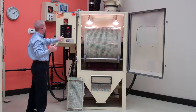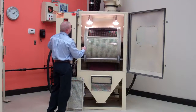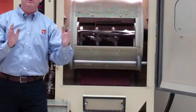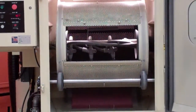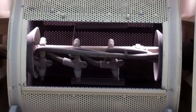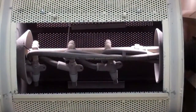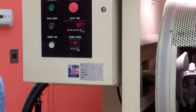With the BB-4 3K, you have three oscillating suction guns — I'll show you as it comes around. It's a seven-inch stroke, which is required in order to cover all angles and areas of the basket. This pneumatic oscillator in the rear is very simple, easy to use, and very dependable. What is different with our unit versus others is that a lot of people will throw four to five suction guns into a barrel like this to get coverage. We only need three due to the seven-inch stroke oscillation.